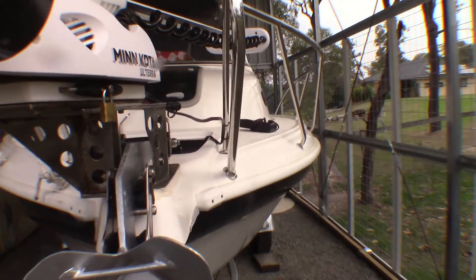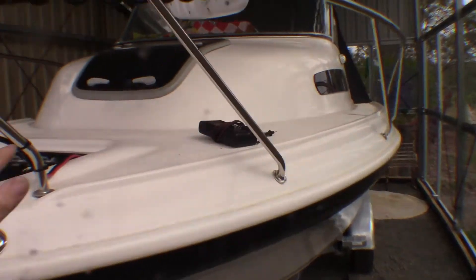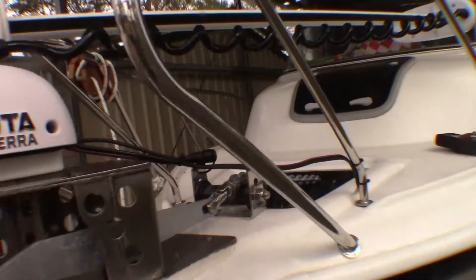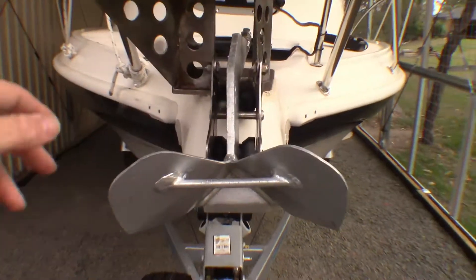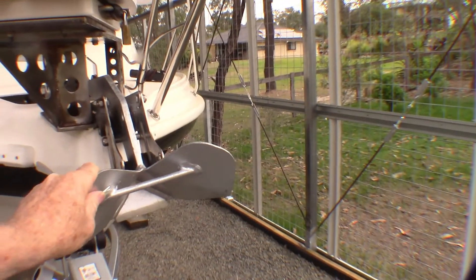Now if you're adapting it to something like a Baseport 640, from what I've seen of them the sleeve of the cabin starts out a lot closer to the nose and goes up on a shallower angle, so I think you'll still have plenty of room. This mounts a long way above the deck because of the height of the bracket that I had to put it on. You need to angle your bracket out enough to make sure that your motor unit and your propeller clear your anchor.